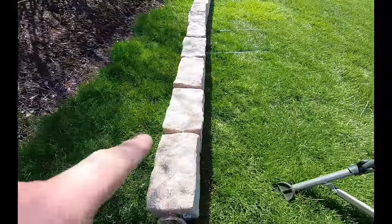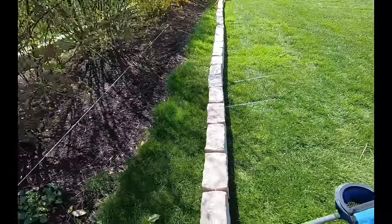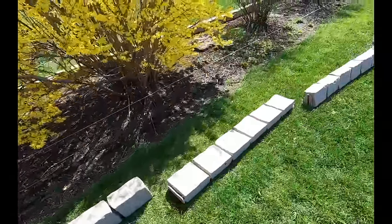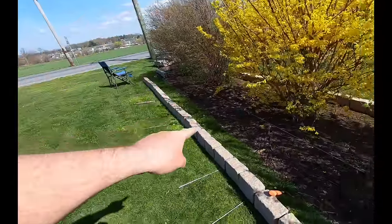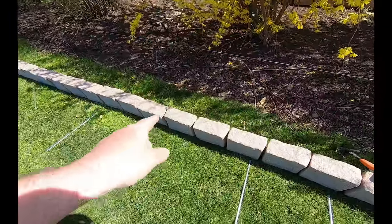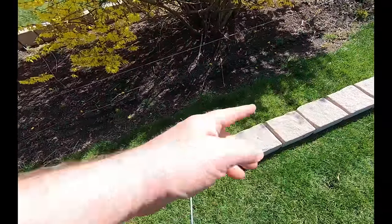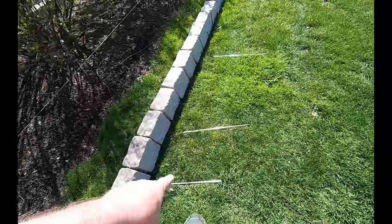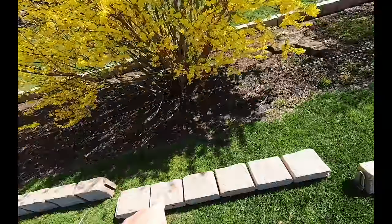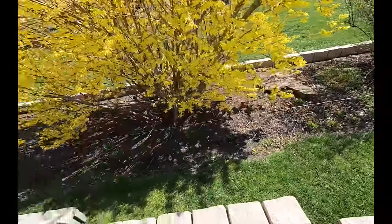So what we're going to do is put seven or eight of these together — seven of them would make about 28 feet — place them together and then put that whole piece in as one unit. That way I'd be able to spike back into here, leave this here unspiked, then just lift this piece up and go on with my next section. We just laid our spikes out approximately where they're going to go in, then I'm going to hook these other three to this line, push the whole thing over, line it up with the string, and start spiking it in.